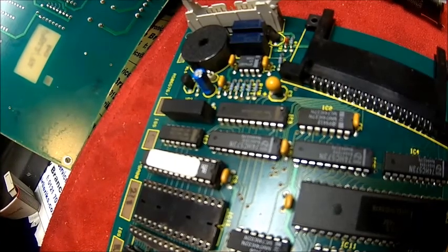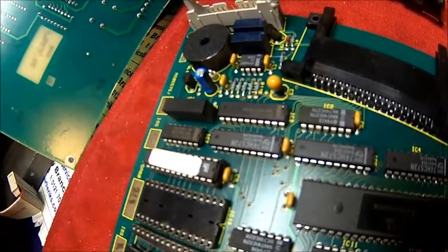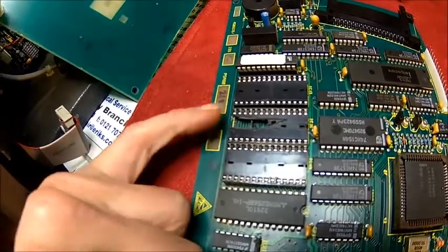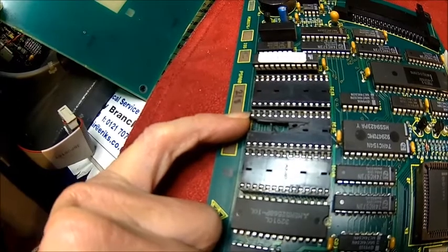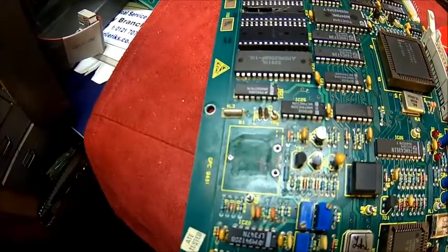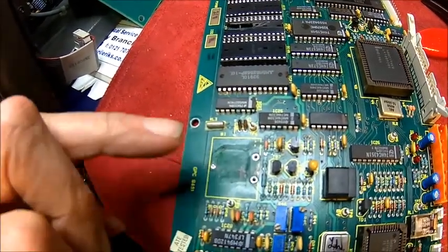We'll find out by following the tracks. We also need a link from this resistor — both sides — to one of the pins here because we have that cut track. We need to clean the socket a little bit. I think that pin isn't actually connected; I haven't checked the spec sheet of the 27512, but I think it's a programming voltage pin or something. We'll also fit a gold cap for now just to make sure we have that voltage — it must not be more than five volts, otherwise the gold cap just goes pop.